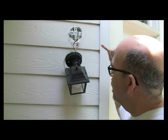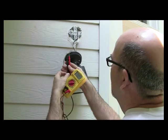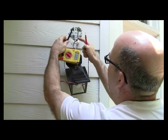As you can see here, I've already taken the light away from the house, and this deck light on the back porch is not working. We've already tested with the light bulb — it's not working at all. What I've done here is just take the caps off. When you're working with electricity, make sure that everybody in the household understands not to touch switches or anything in the panel. You're the only person that will do that. I'm going to take my voltmeter, turn it to 200, take the probes, and touch here on either side — and I have nothing showing whatsoever. It's completely dead.